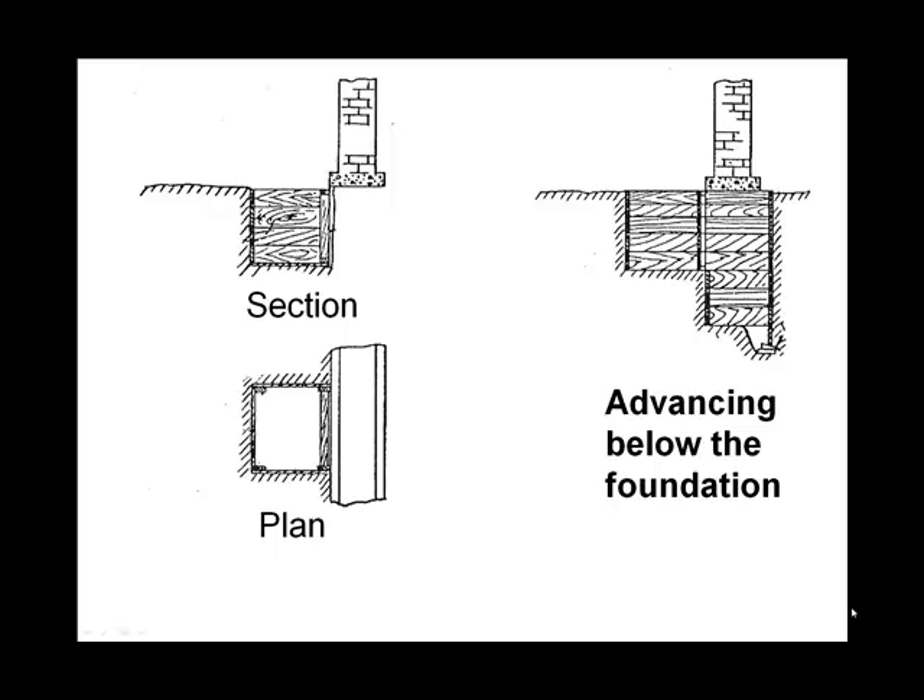After you've done one pit, you can skip a space, do another pit exactly the same way, fill that with concrete, advance to the third pit, and so on. Then you can fall back and do the intermediate pits. Depending on the soil conditions and the absence of obstructions, you actually make excellent progress doing this. Everything is done by hand — the excavation, the material lifted out with a winch and a small pail. The timber planks are cut to size and lowered down the hole. This operation looks the same way it looked a hundred years ago, but it is an excellent practice and produces a continuous concrete wall below the existing wall that you want to re-support, making it enormously effective and enormously valuable.